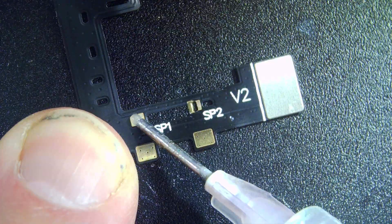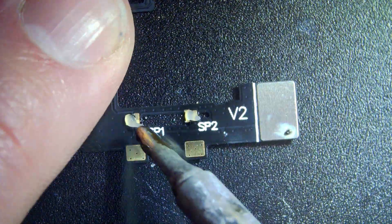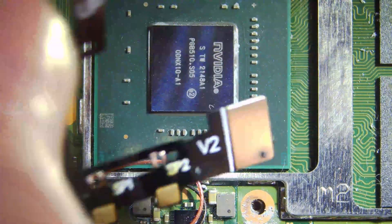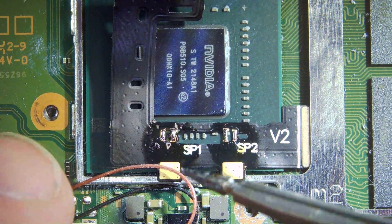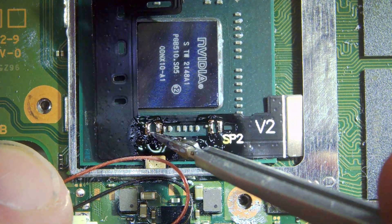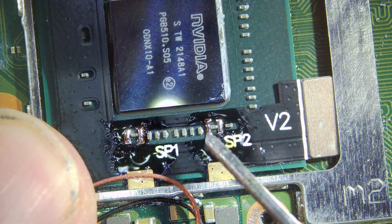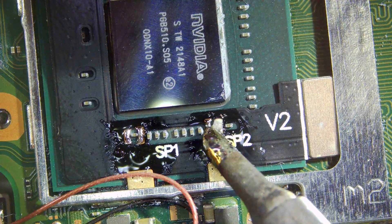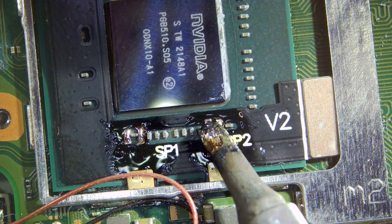Then we just need to prep the ribbon cable. I just get a little bit of flux and a little bit of solder onto these four pads here, getting it all ready. Then we just position the connector into the right place — just gently make sure that the two tabs come underneath the shield in there and then line it all up, making sure that all the caps on the left line up in the right position. Then we'll apply a little bit of flux and apply the solder — you just need to solder to either side of the chip.